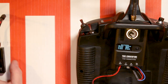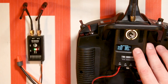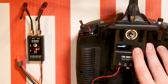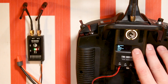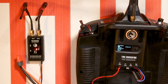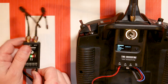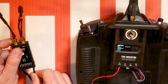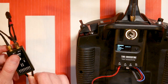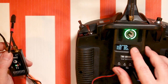Let's bind it up with this receiver. Binding is pretty simple with the Crossfire devices — you just hold this button down, go to the Xfire transmitter menu, and hit bind. We've bound up to our receiver. Sometimes with Crossfire receivers you do need to rebind every once in a while to authenticate properly — it just kind of depends, so if it doesn't work, try again. There we go, I think it bound this time.